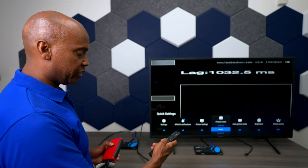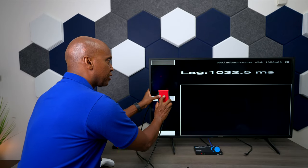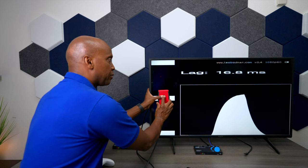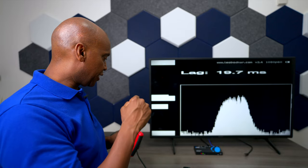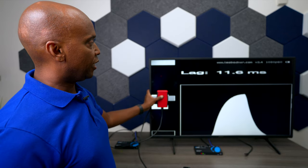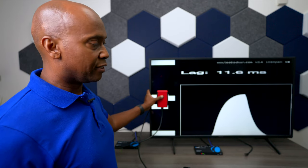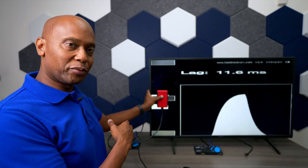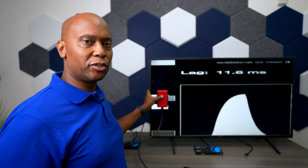The audio right now is coming out of the soundbar — that's a pretty cool feature. The next thing I'm going to check is the input lag using this Sony TV. In gaming mode, connected directly to the television, we're getting about 16.8 milliseconds. Now checking the input lag going through the sending device — it looks like we're going down to 11.6 milliseconds. So it seems to actually be faster going through the adapters than going directly to the television, and you're not going to lose any response time.